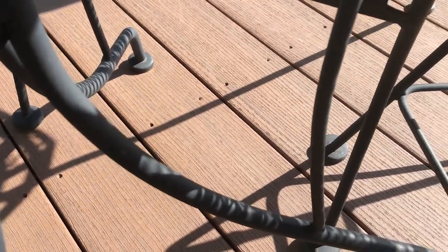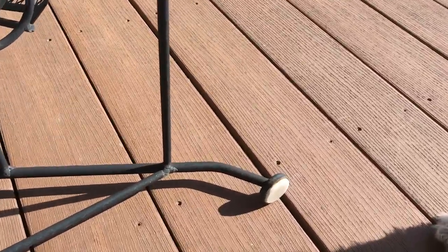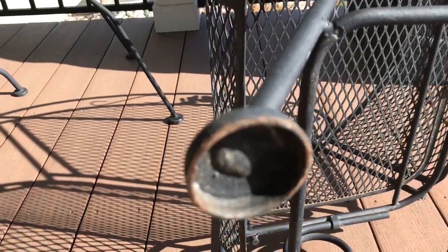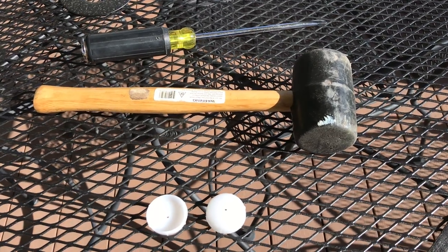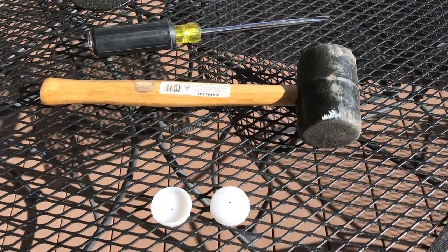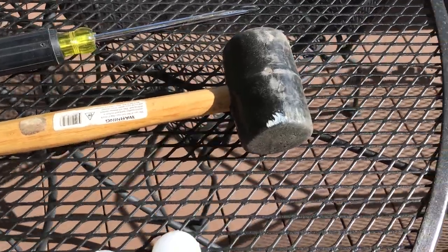There are a few good ones left, but we'll get started. As you can see on the bottom of the chair, we've got one decent cup in place, and here we've got a broken out one — empty and broken out. The cups are fairly readily available online; you just have to make sure you get the correct diameter. I believe mine were an inch and a half. I'm planning on using a screwdriver to take the old pieces out and then just mallet them in with a rubber mallet.